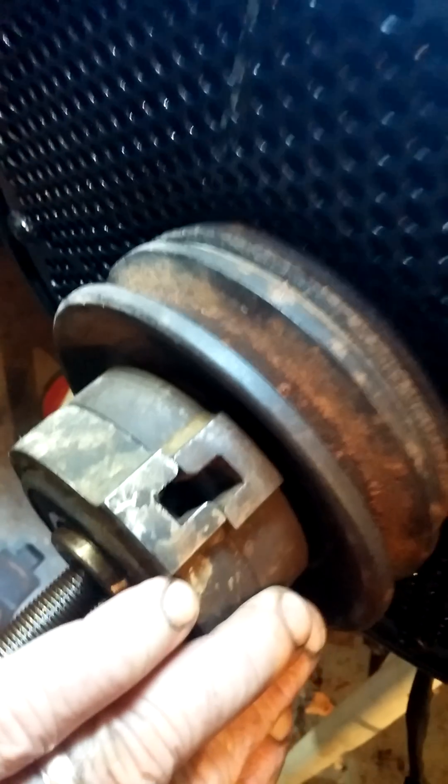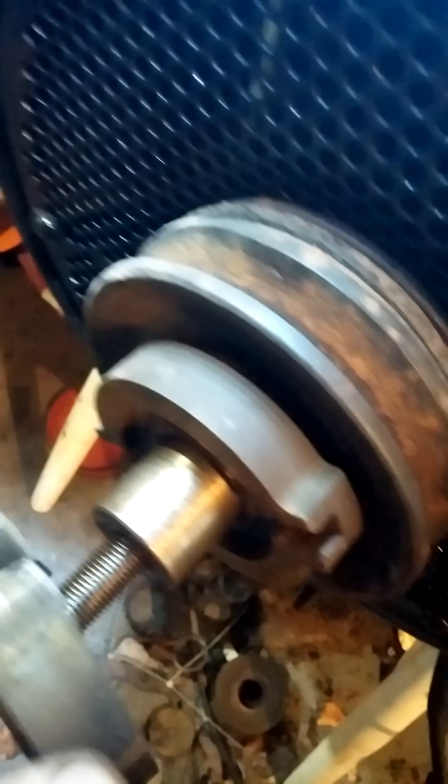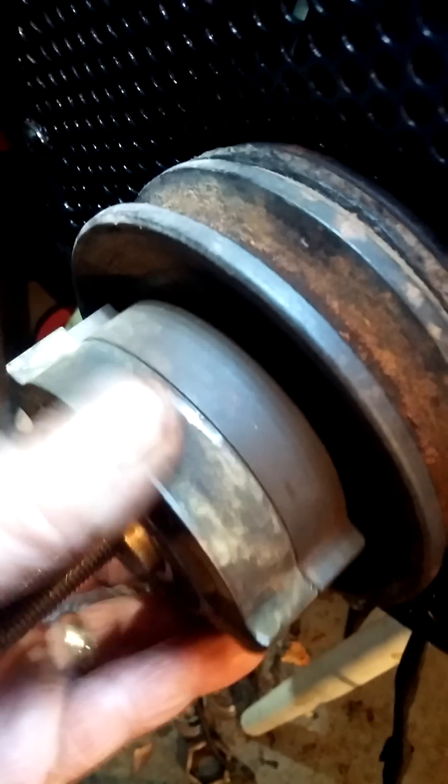Next up are your actuator cams. The cams are a little bit tricky because they're to be offset. If you put the first cam on and the next cam on like this, you can line these shoulders up - see how it's lined up here and on the other side they're also lined up. This is no good. So what you need to do is take one of them off and flip it over, so now when one side's lined up, the other side's way offset. This is when you're right.